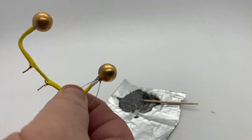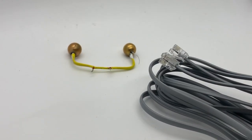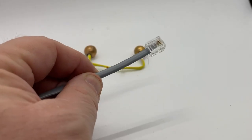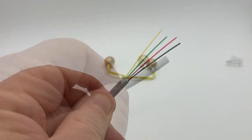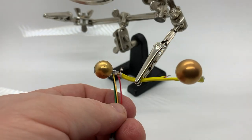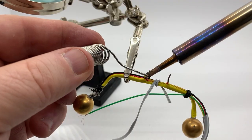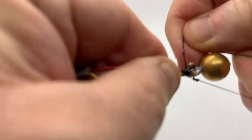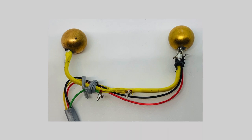Carefully remove any excess epoxy with a damp Q-tip. Do a continuity test to make sure the resistor's leads are still electrically isolated from the ball, and let the epoxy set thoroughly before moving on. Then mix up a little more epoxy and use it to install the thermocouple junctions — one into each ball — in exactly the same way as you installed the resistor. When the epoxy sets, strip and solder two wires to the resistor and one wire to each of the leads of the thermocouple using four-channel telephone wire. Since these connections can be delicate, keep the wires from moving about by tying them to the instrument directly.